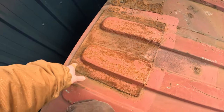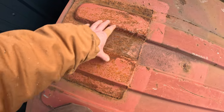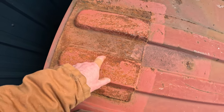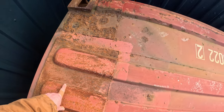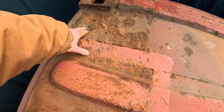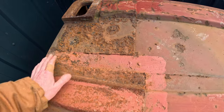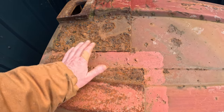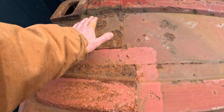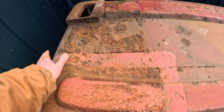Now this is obviously a patch — they cut a hole out one time and put a new piece in and they've obviously welded that up properly. You'll probably see they've patched the inside as well. Now there's a dip here — there's a dent and a dip — so when we paint this container we'll really need to fill this area up, either with silicone or some kind of paste, or a really thick layer of paint, to make sure the water runs off and doesn't sit there.